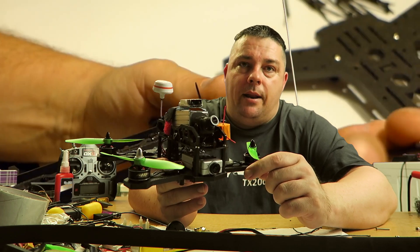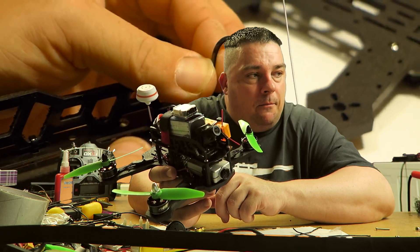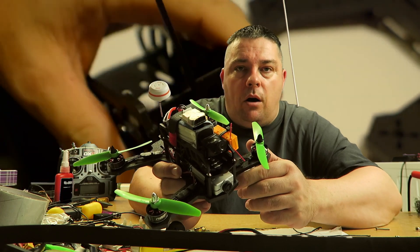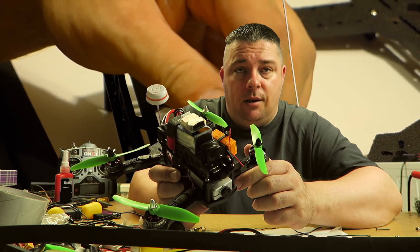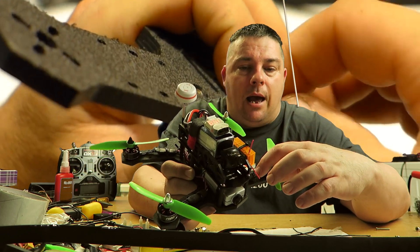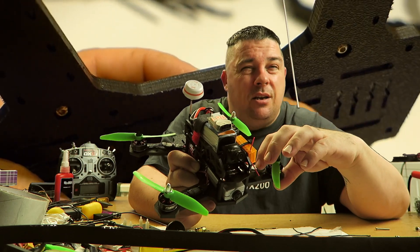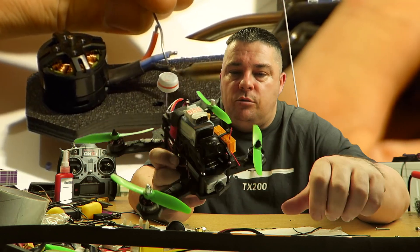I want to get out and fly it now. Just to talk about the CC3D quickly before I do get out in the field — the CC3D makes the integration of OneShot125 very easy. As part of the wizard that you go through to set the CC3D up, there's just a little checkbox or icon you click that lets it know you're running PPM and that you'll be running OneShot125 on these SN16 ESCs. I actually did the same thing as in the build video and resoldered the wires — just makes it nice and tidy.